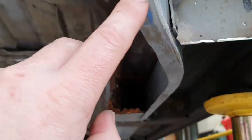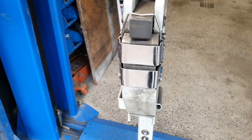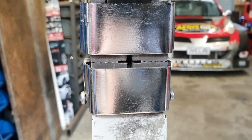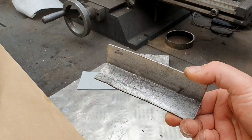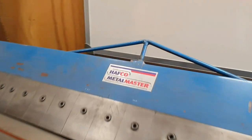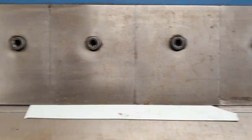It does straighten out, but this fold doesn't. It curves up and it's doing that curve while going around a curve that way, and then coming back again. At that point we can use our stretcher/shrinker — this is just a little machine where you put your piece of metal between these jaws here. It'll clamp the material and then stretch it out wider. They're a pretty cool toy to play with. Let me find a bit of scrap metal for a quick demonstration — that'll do.